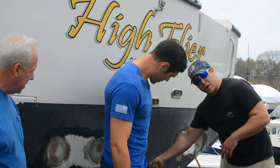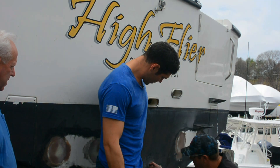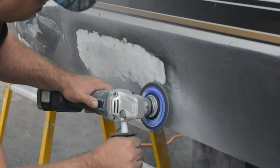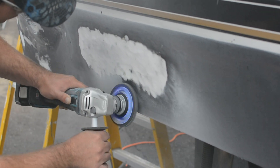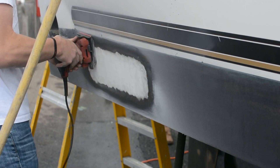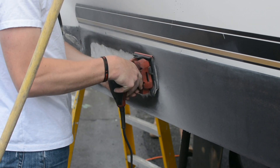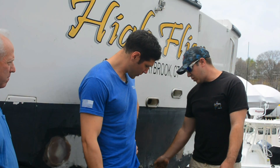Basically what I did, just took a grinding wheel and sanded the boat paint that was below the water line. Wanted to make sure we didn't take off as much of the gel coat as we could. But after we used the grinding wheel, we used a sander, made it nice and smooth, and then cleaned it off with some acetone. So it's a completely smooth surface ready for the lights.